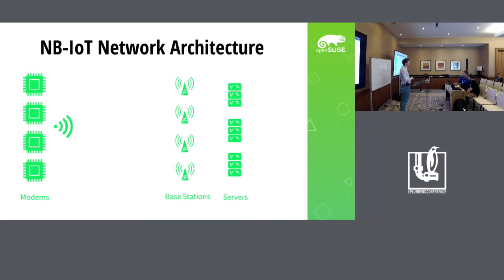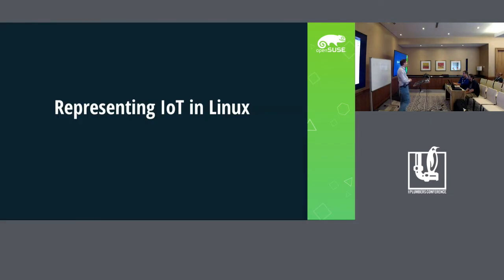It's kind of easier for software in that it is being abstracted by an AT command layer. So there's a lot of logic still in those modems, even if they are supposed to be less complex and less power hungry than a regular 4G, 5G modem. And you are essentially just tunneling UDP, IPv6 data from your end device to whatever service you want to get it to. There are exceptions to that rule that I've just made, but that is basically the rough picture.